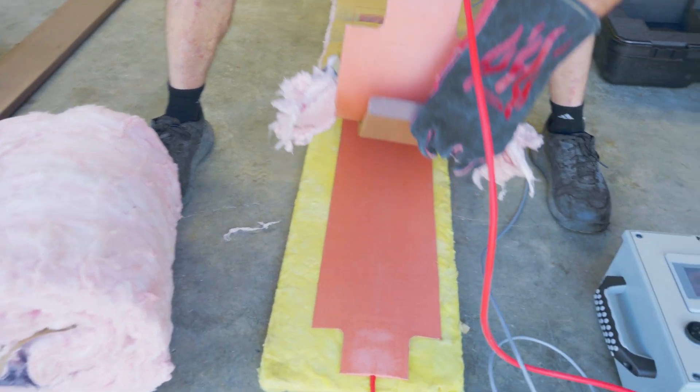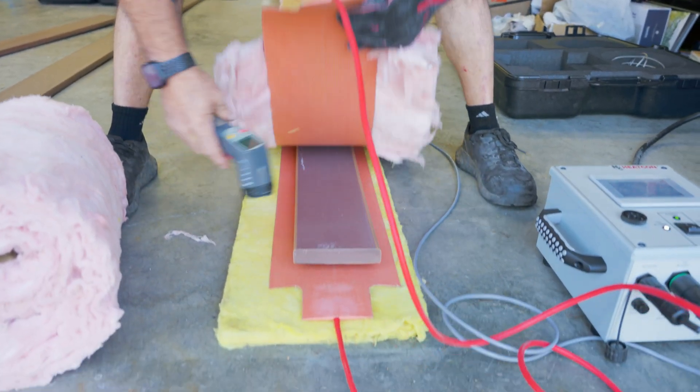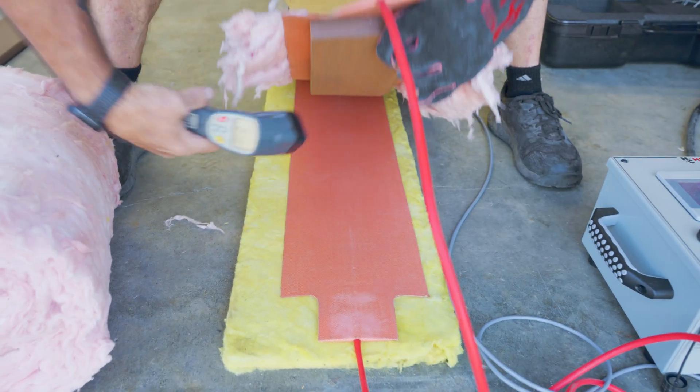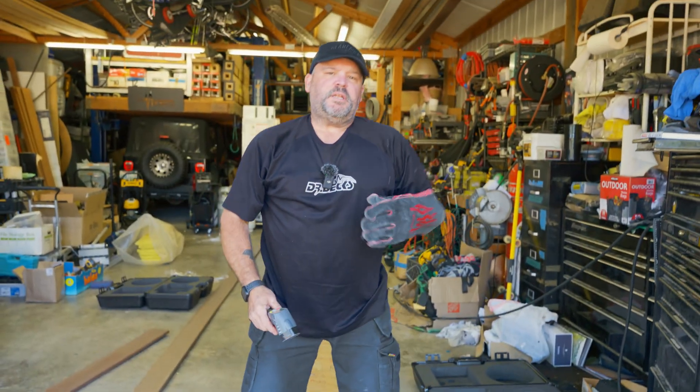Here are the blankets and here's that board — she's nice and pliable. The top blanket is set at 250 and it's heating the board to 220, so there's about a 30-degree temperature fluctuation, and the bottom of the board is at 180. The board is about 20 to 30 degrees cooler than the actual programmed temperature. If I was doing a tight bend, I would bump the program temperatures 20 to 30 degrees to get the bottom into the 200 range and the top into the 250 range. But right now, for a 10-foot radius or larger, I would just pop this board in my form and make it happen. This is a really cool system — I'm really stoked and excited about it. Keep watching for subsequent videos on what we can and cannot do with this new HeatCon heat forming kit.